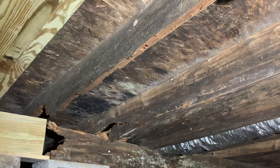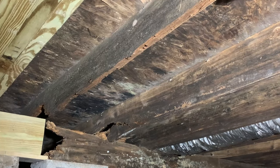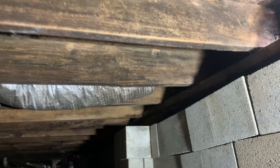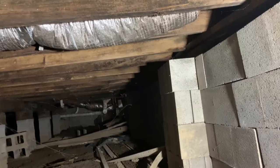The house is a 50 by 30 home and we're remodeling as we go. The joists are in horrible shape — they're two by eight joists, plain standard lumber. The foundation is solid underneath the home; however, the blocking for the home is — well, here we go — it's just dry-stack blocking. See that? And then in certain locations it's double-stacked blocking.